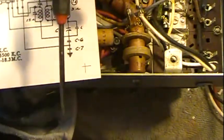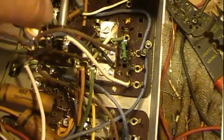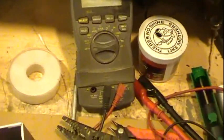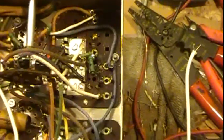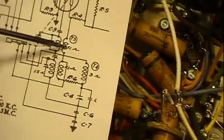Now let's look at these two guys here. They'll be easier to see because they're not on the back and kind of hidden. That's sometimes what you run into, because some of these switches could have several wafers, or even two wafers, but with one wafer pretty darn tight to the chassis where you don't have a whole lot of room to look down into it. Sometimes the best thing to do is use a continuity tester on your meter, where it buzzes. Of course, just make sure you may be connecting in some really low ohmage coils. Some of these are less than 1 ohm, so that's going to make it buzz too. So you kind of got to watch it.